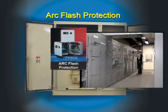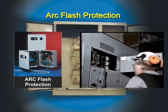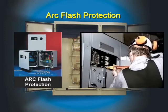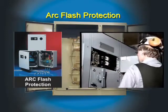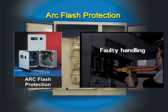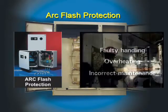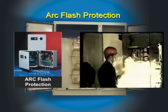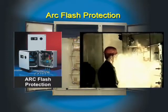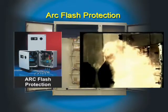In recent years, major resources have been devoted to enhancing safety and reliability in low and high voltage switchgear. But despite the fact that modern switchgear is much safer than previous designs, the risk of an arc occurring can never be entirely eliminated. The most usual causes are faulty handling, overheating, and incorrect maintenance. An arc rapidly gives rise to a very powerful increase in pressure. At 10 kV and a short circuit current of 40 kA, the pressure in the vicinity of the arc rises to about 15 tons per square meter within 10 milliseconds.